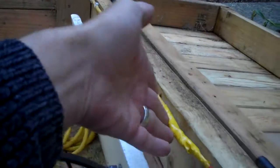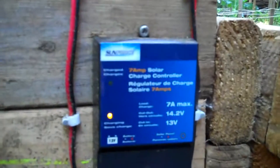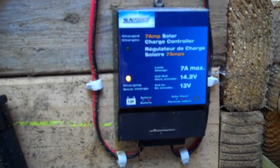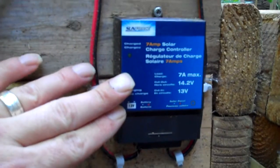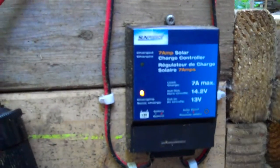This is the wire coming from the solar panel, with another soldered connection. It goes into a 7-amp charge controller. I'm running 5 amps of solar panels, so these little charge controllers are very cheap and small — they don't tell you exact amperage, just whether it's charging or charged. Basically this keeps the solar panels from overcharging the deep cycle battery, which is also a no-no.